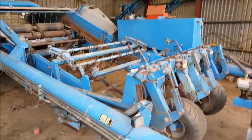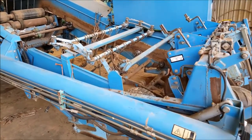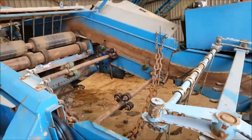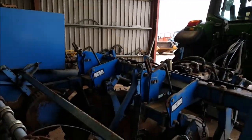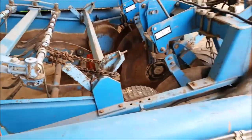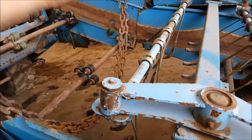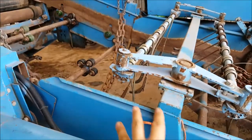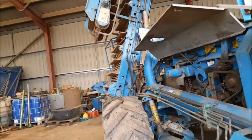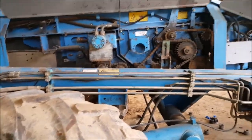Safety devices on this are similar to a shear bolt — it'll have fail-safe areas where it's designed to break if the machine is overworked or over-stressed. So say while you're digging up your potatoes you also get a massive boulder — to stop that going through that smaller gap. More likely the driver will spot it or notice it when the machine grunts, because the machine has a small brain to it and should sense something's not right. The webbing has a fail-safe breakage edge where the smallest part of it will break and it'll just flop down. Before you get into the smaller intricacies, you do have fail-safes on your chains — weak points there — which just stops you messing up your hydraulics, because obviously a chain is going to be cheaper than your hydraulics.